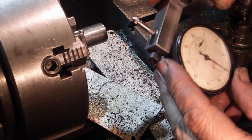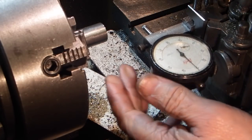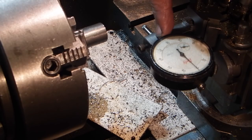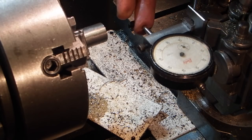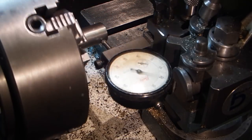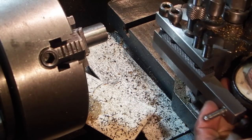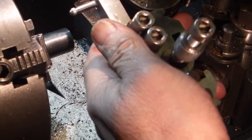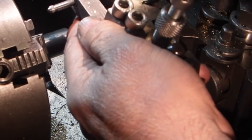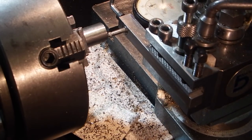In the end there I've put a 5mm cap head. You could use a grub screw and it grips the dial indicator okay. The good thing about doing it this way — if you just use the cap head straight onto the dial indicator you end up damaging the bush on the end of the dial indicator and then it stops moving. With this I can get in on my four-jaw chuck. If I want to clock up the face there are two ways: I could just turn the tool round, or I've turned the dial indicator completely around to the other side. Slacken off, turn the indicator around, tighten it up — that can then go in the tool post on this side to get into the face.